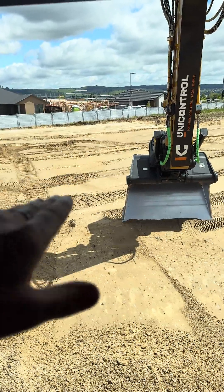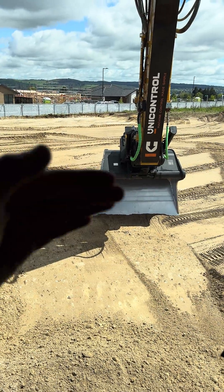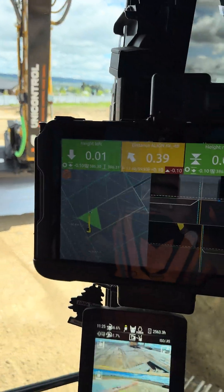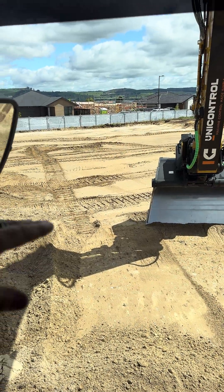So when I go down the hill to cut out the pads, I over-cut and hold slope on the edge — so you're not trying to guess and it doesn't lip up as you come across. When you come down and cut the lines in across for the edge of your house slots, you've got a nice clean level sharp batter between all the lots.